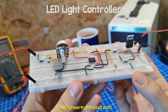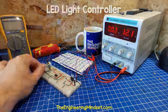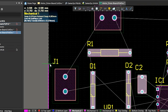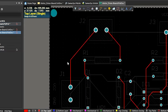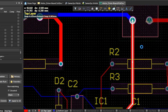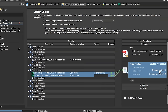I then build a simple prototype to check it all works and it seems to be fine. I can adjust the brightness, so we will finish the PCB design. We import the components to the PCB design file and spend some time arranging these around the board. We then define the board shape and add any annotations. We generate the route to connect everything together, then we increase the track width for the higher voltage and current areas of the circuit and also check the routes and move them if needed. Once satisfied, we create the polygon and then export our Gerber files.